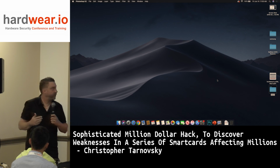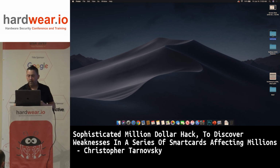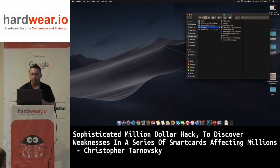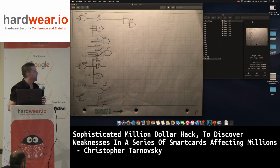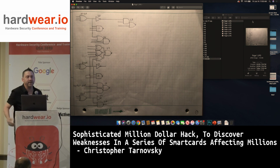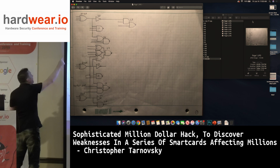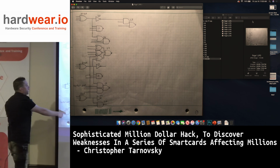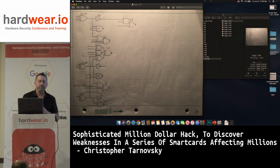Because, I didn't show you yesterday, let me see, I can find them. On that Samsung chip, I started to make schematics of the crypto block. XOR decode. So this is real world. This is not Oliver's world. Oliver's tool would have done this in seconds. But you can see here, I'm starting to put their cryptographic block back into schematics. I think everybody here can read that clearly. So here you can see the D1 XOR, D0 XOR, how they interacted, D2 XOR, and then I started labeling I6, I9. It can be a lot of work at some point.